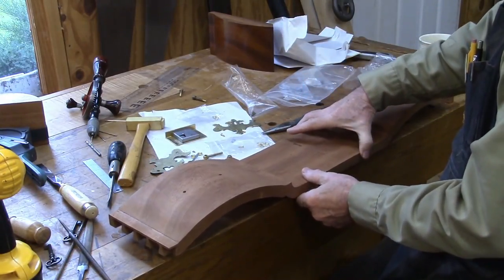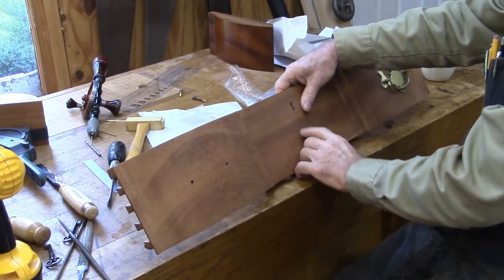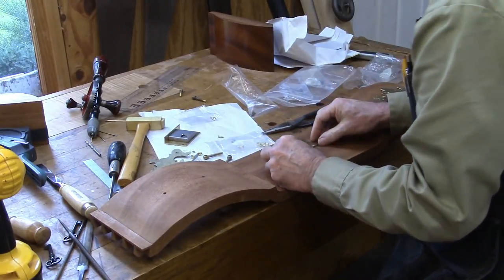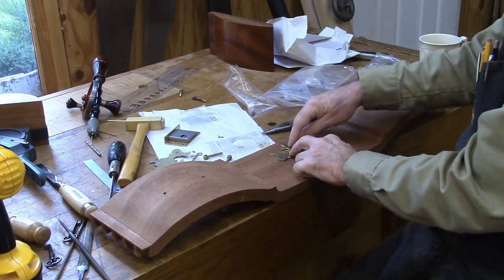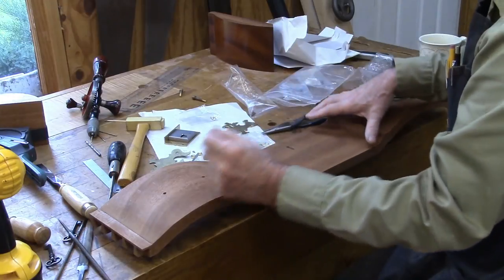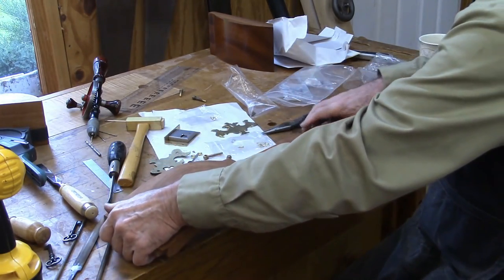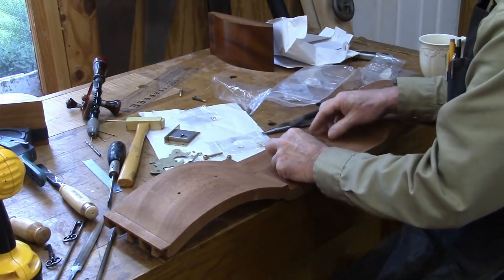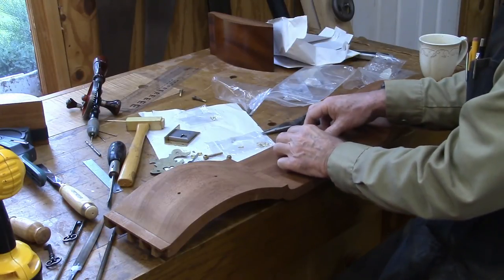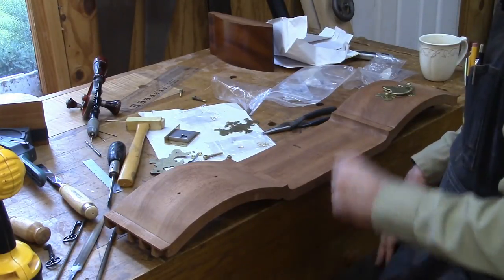The hardware came in. You saw me chop out the mortise for the locks, and then with a hole saw I was able to elongate it. The reason I waited was so that I could position the escutcheon plate exactly where I wanted, and then trace where the elongation of the lock hole should be. Then I used a round file to smooth it out and to enlarge it slightly. I marked out with a pencil where I wanted the escutcheon, marked the holes, and used an awl to pilot the little brass nails that go in there.